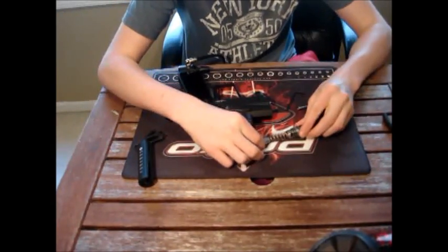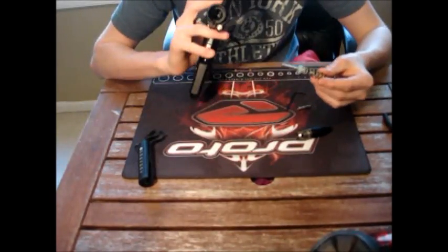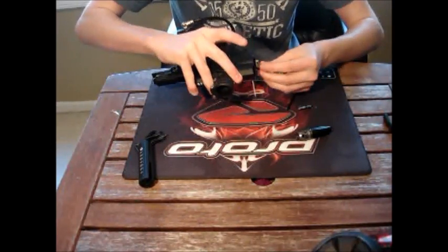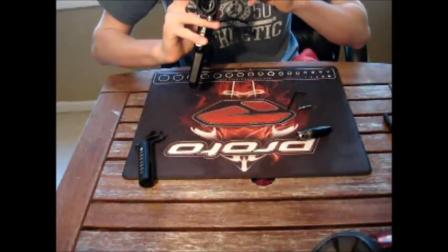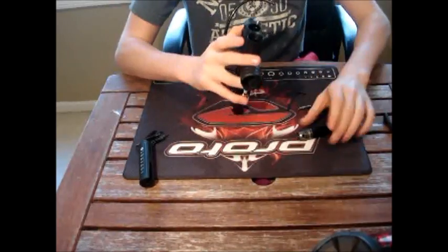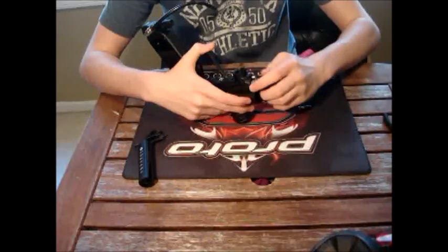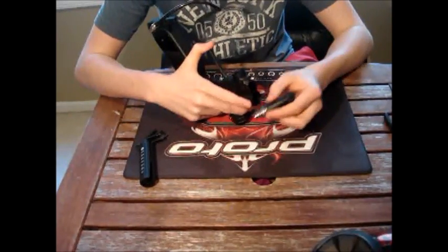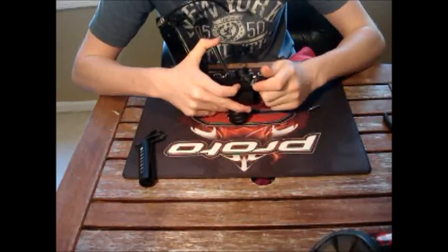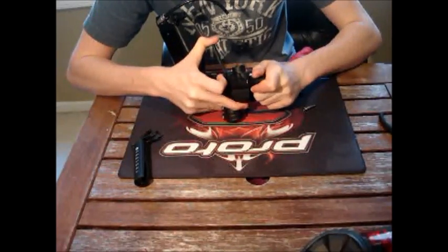It's very easy to put back in. The easiest way is the way it came out — there's a little tiny hole that this goes into, which is actually in the rammer. Got it in on the first try. You know it's all the way in when the spring sinks down below the face of the exhaust valve. You want to leave these o-rings up, and you will have that tension on the spring on these o-rings. You can hear it pop right back there.